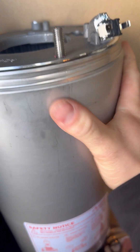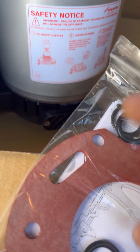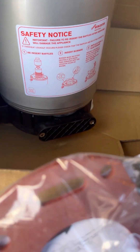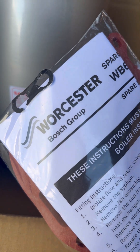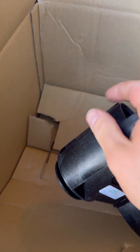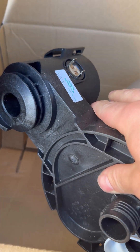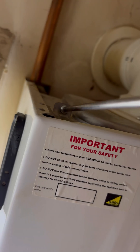Get the flue start and get the back inside. Get it over against that, although sometimes it's smashed off. Get the spacer, get two O-rings, and then you get those little C-clips. Get that clip on. One thing I always do is shut the bottom to check if it's cracked — I've fitted one before where something was cracked, it's a pain in the ass. First time, flip the power off, undo the four screws to whip the case off.